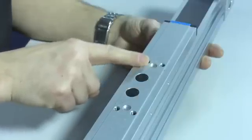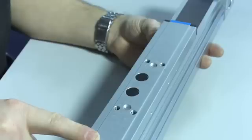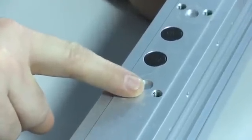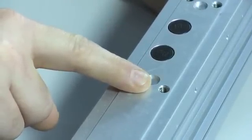Electromechanical axis should incorporate low-inertia components wherever possible. The ELGA is no exception, with a lightweight aluminium carriage. However, with such high loads, it is critical to ensure that any mountings are secure. Festo helicoil all mounting threads in the aluminium to increase reliability and robustness of the drive.